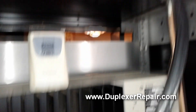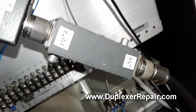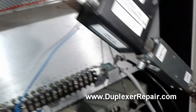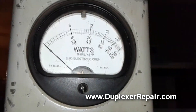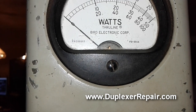We have reconfigured the cabling so that we're going from the PA up to the Bird watt meter, which in turn goes to the isolator, through the bi-directional power meter, and then to a 400-watt load. Let's see what happens in terms of forward and reflected power measured by the Bird watt meter — with the load on, and then when we take the load off.